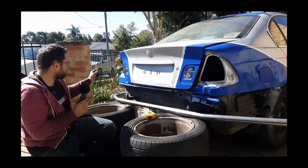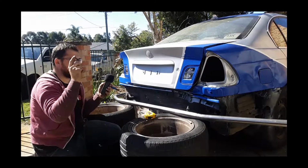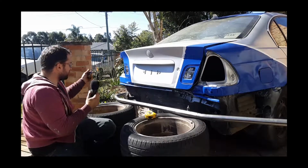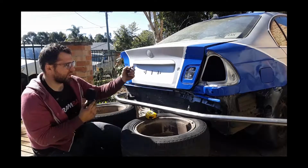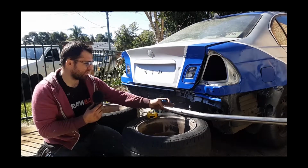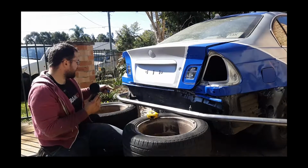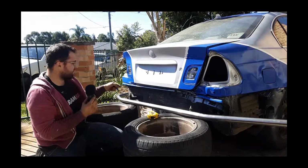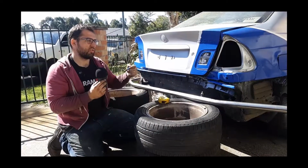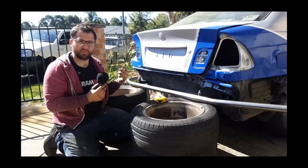But using the measurements from this point. So for example, I wouldn't start by bending the furthest bend. What I would do is work from this point to this point with the tube in a certain direction. Then when I came to the middle point, I would do this next bend, but with the tube flipped in the other direction. So I'm not going this way and then that way, but I'm keeping in mind that I should put the tube in the opposite way. I'm going to need to think about that, but that's what I've kind of figured out so far.